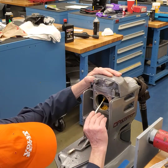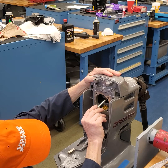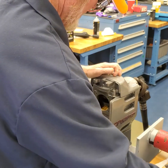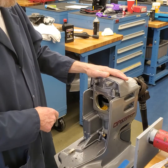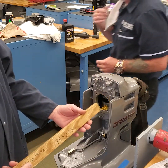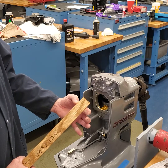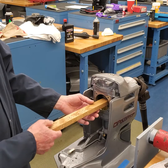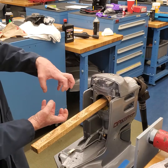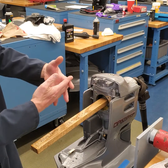I'm going to do the upper one as well. I really focus on the lower gear but like to check the upper for my own reference. Now that that's marked, we're going to load the drive and rotate it. My lab assistant Paul is going to hold a stick — a piece of oak I made, about three-quarters of an inch thick and an inch and a quarter wide, cut from a pallet. It fits between the two cups of the gear. He's going to push down on it to put a load on it while I drive the gear teeth to simulate engagement, which will cut into the marking compound so we can see the contact pattern.